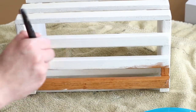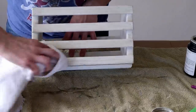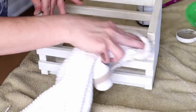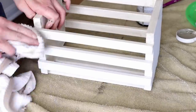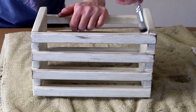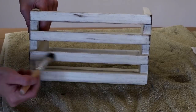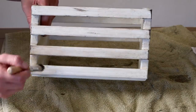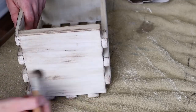Once this paint is completely dry I took an old towel and this Folk Art wood tint in the color gray and applied it to my wood crate just like I would a wood stain — put it on the wood and then wiped it right off. This is really nice because it's washable with water and doesn't have any really nasty smells like a regular wood stain would. Once that was dry I took my Dollar Tree stencil brush and my java colored chalk paint from Folk Art and dry brushed this on the crate anywhere that I wanted it to look aged and worn — not on the entire crate, just in the spots I wanted it to look distressed.